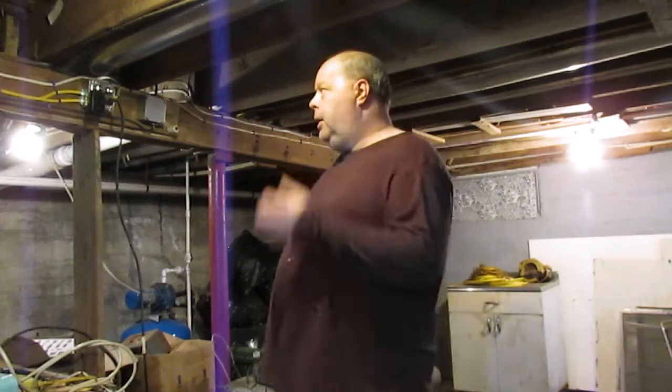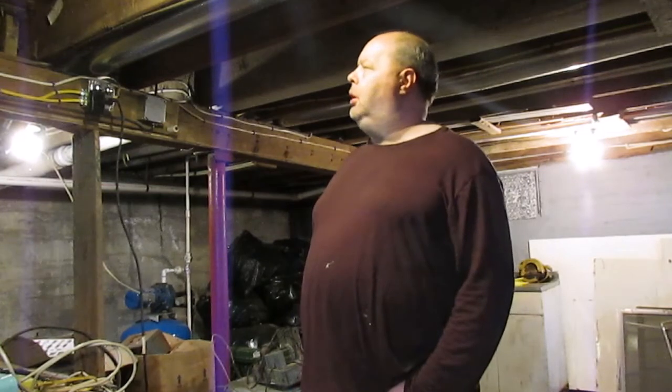Okay. Now keep in mind, when my mom and dad lived here over 20 years ago, this house had a 60 amp service entrance panel on it. It had a 2x4 60 amp box. It had a main disconnect and a range disconnect, and it had 4 circuit fuses, and I think there were two of these boxes like this spliced on there. One of them ran the hot water heater and the other one ran the electric dryer.